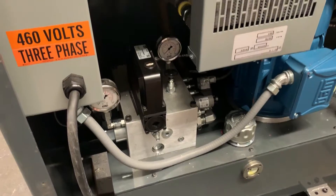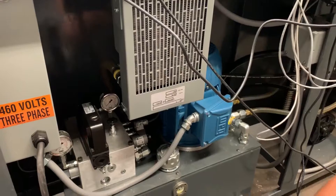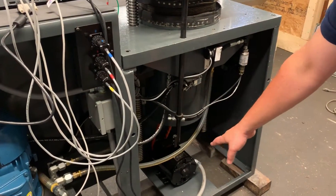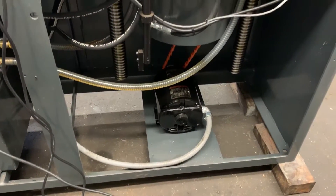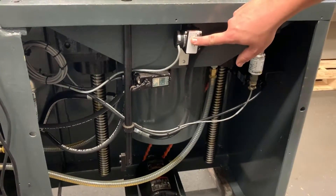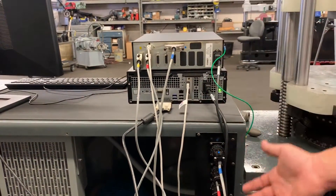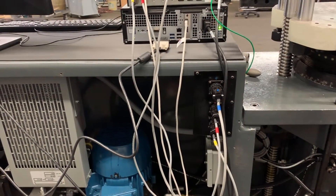All new electrical, plus a nice little air heat exchanger to keep that oil cool for a longer duty cycle. Still retaining limit switches, crosshead motor, new belt, all new electrical running to the frame, new pressure transducer, new Celesco position encoder. Proper grounding for the signal control box, and all the signal cables coming in separate, coated, easy to see and easy to put together.